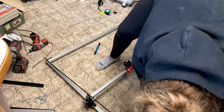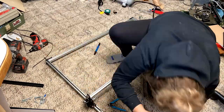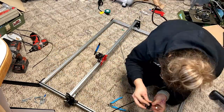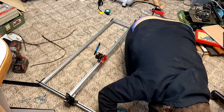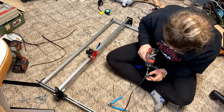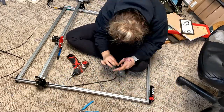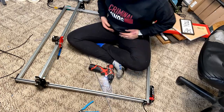I also realized that I bought the wrong extrusion — I bought the t-slot instead of the v-groove slot. That's why I had a little bit of struggle trying to get the rails to go smoothly, but I eventually got the wheels to go on right.